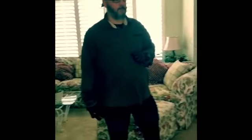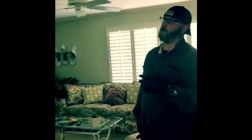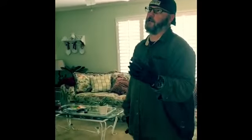Okay. Any other informational tips or tricks that we should be aware of, or even specific to this property that I should be looking at today? Well, with any property, we like to see for their HVAC, your air conditioning and heating. As for the air conditioning, we like to see that the air being forced out of the registers versus what's being pulled in through the returns is about a 14 to 18 degree difference. This house is sufficient. It does have that. We let it run for a little while, and then I check the air temperature coming out of all the registers in the property, and then the returns as well. So it's about a 14 to 18 degree difference is what we like to see.